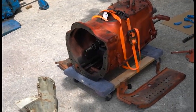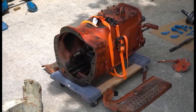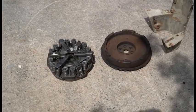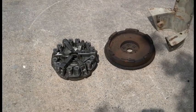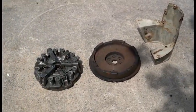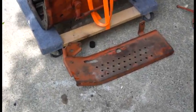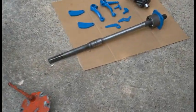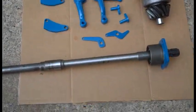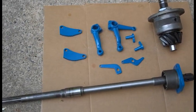I'm converting mine to a five-speed with live PTO. One reason is I really like the 861 transmission, and the second is I was able to get this transmission and a new clutch pretty cheap — the clutch had been sitting on a shelf for years and I got it for almost half price. So everything just fell into place. You will need a new clutch, a new flywheel, the running board, your PTO shifter, and the PTO shaft.